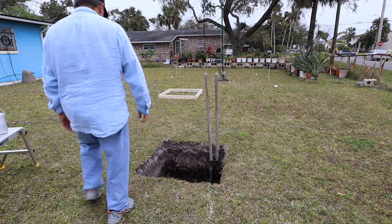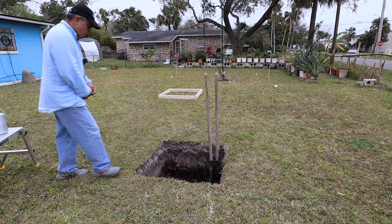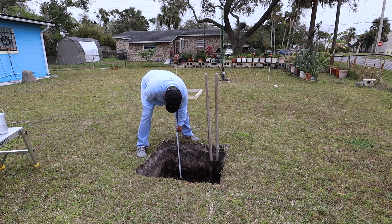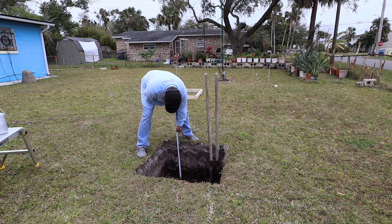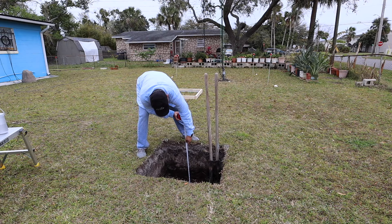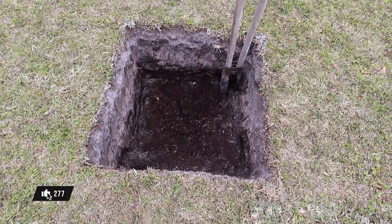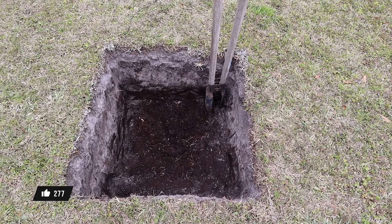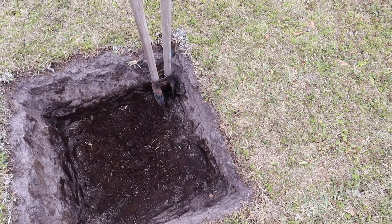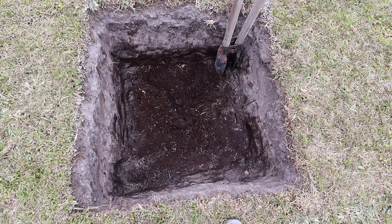Cool beans. We're going on four hours — it's just me solo. Currently we're looking at about one foot eight inches, maybe more than that. Let me look at the middle — it's approximately two feet three inches. So now I've got to go all the way down to four feet. I'm now using a post digger to get those corners nice and square, then loosen up some dirt, dump it in the middle, and then use my shovel to get the dirt out of the hole.